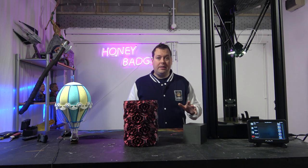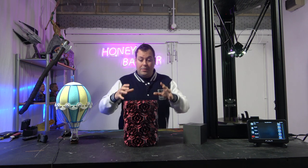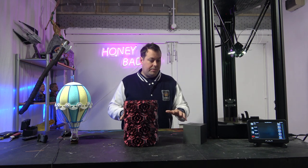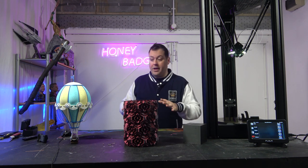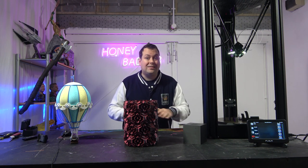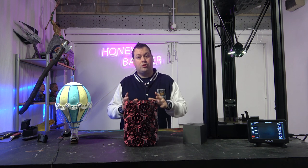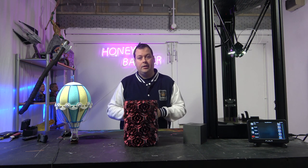It is genuinely moving at 400 millimetres a second and it really shifts — the acceleration is all the way up and the prints it produces are genuinely clean. I turned down some of the speed when doing different models because I was getting rounded corners, since most of the time this thing is printing between 300 and 400 millimetres a second. I found a real sweet spot at about 250 to 300 millimetres a second for really quality prints, like the ropes on that hot air balloon.